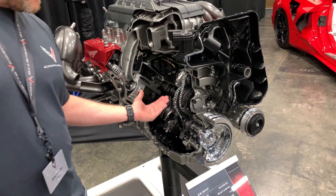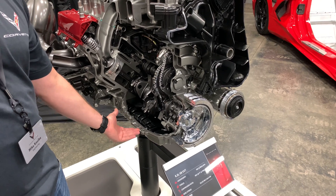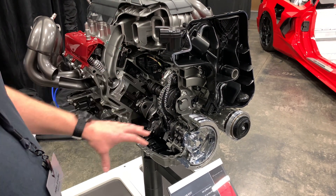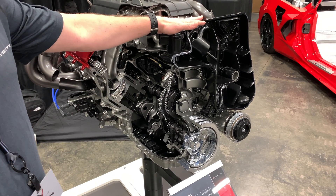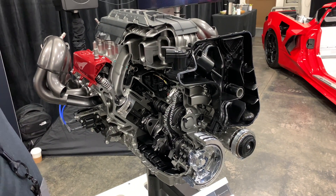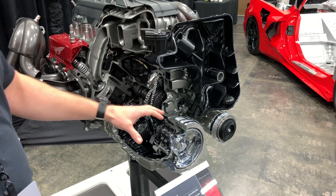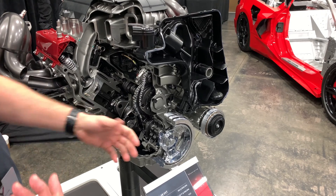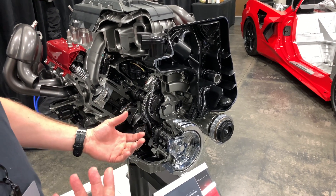As mentioned, the engine is now an inch lower, so the pan is shallower by an inch, basically moving everything up forward. We talked about the lube system that makes this capable. We've re-engineered the dry sump tank — before it was that long cylinder made out of aluminum. Now it's composite and, as you can see, direct mounted. This allows us to get rid of the hoses and extra complexity. Obviously, you also get rid of extra oil that can't really even be used in the system — that's all mass.